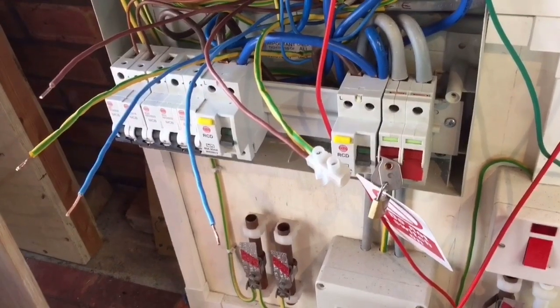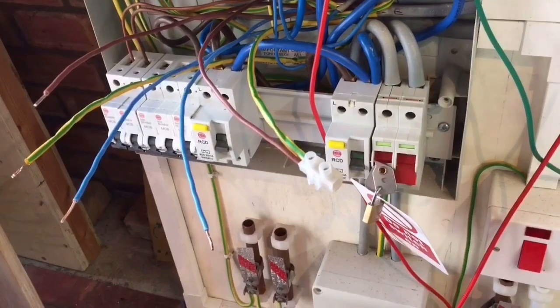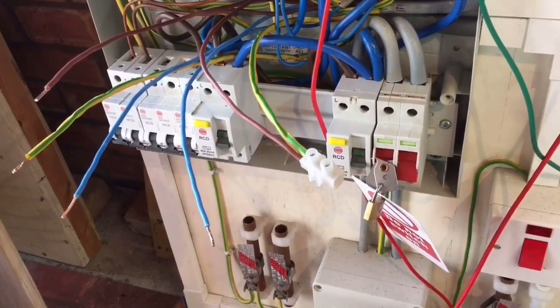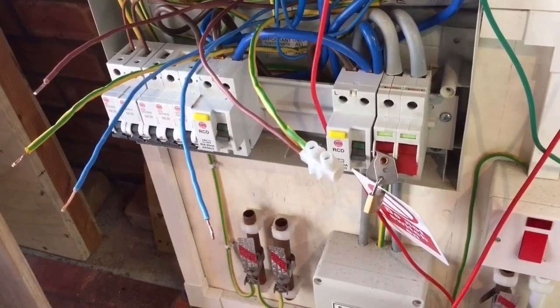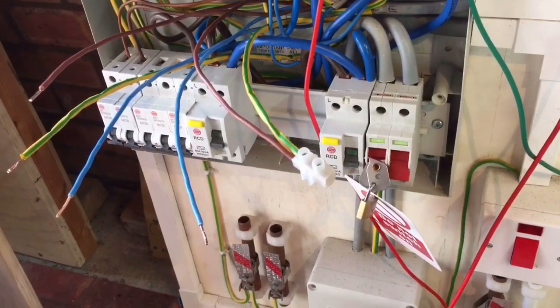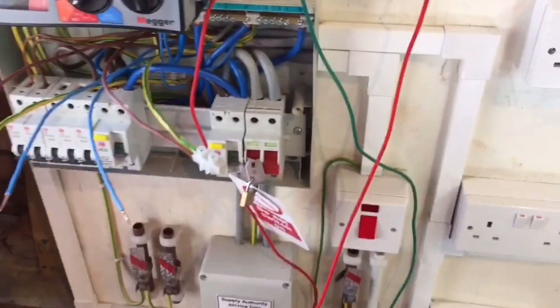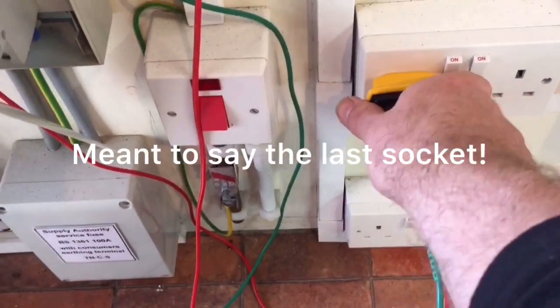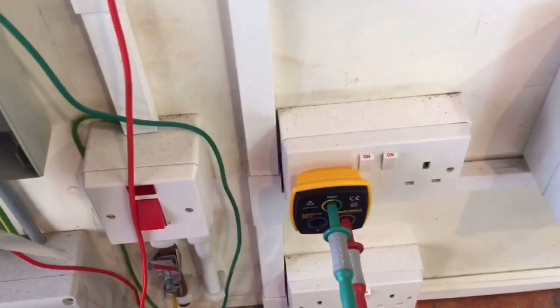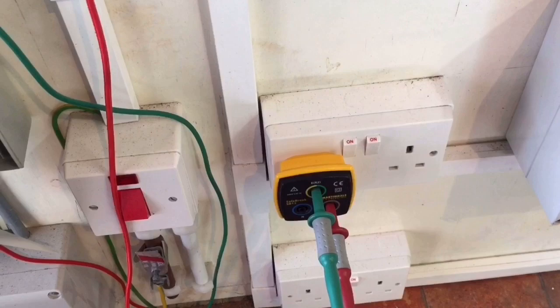Now I've connected the line and the CPC from the other leg of the ring together, and I can go the other way. It's probably a good idea to keep it simple and do it one at a time, because these things always happen in the worst situations when your head's a bit frazzled — the simpler we can make it the better. Let's go to this first socket — getting a beep.